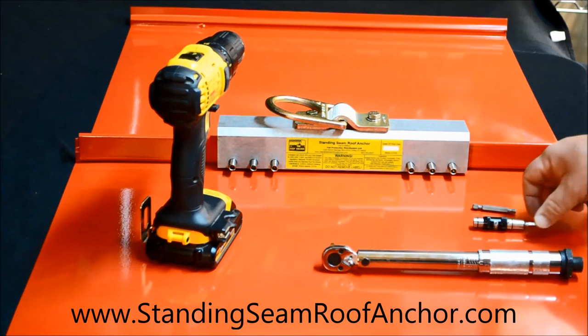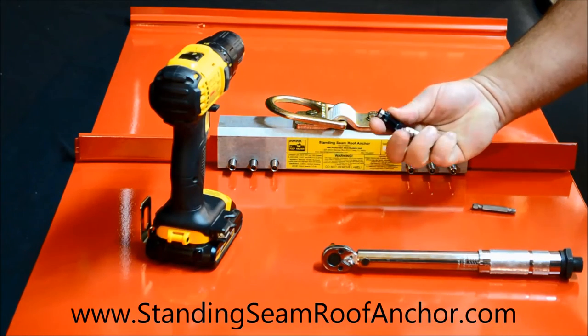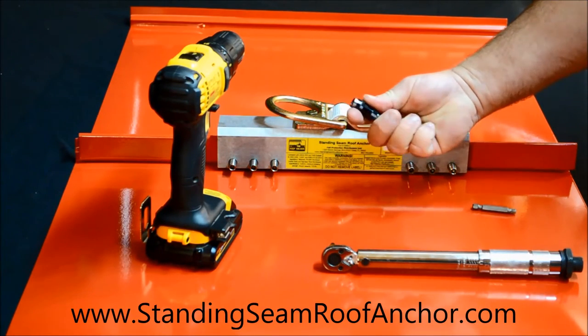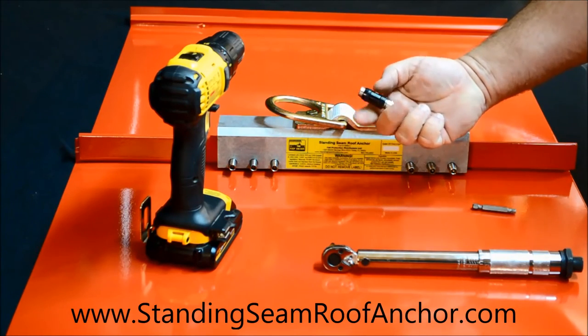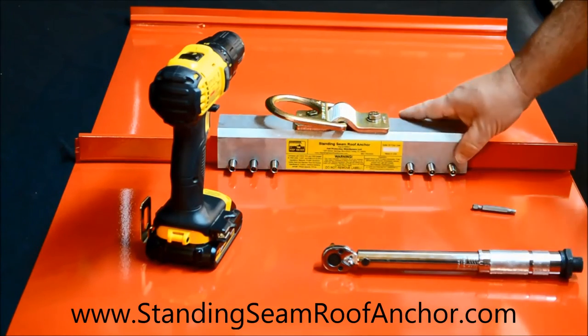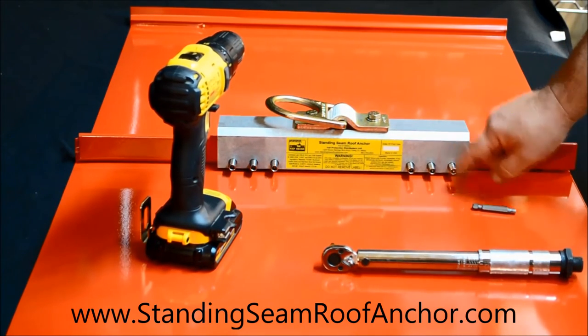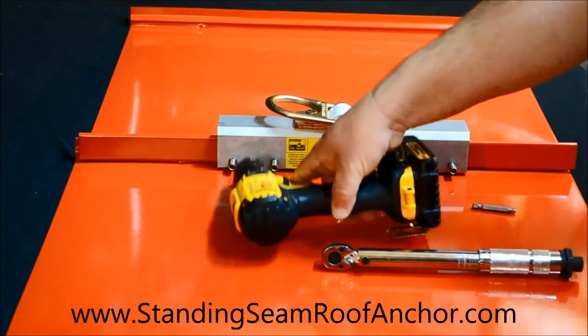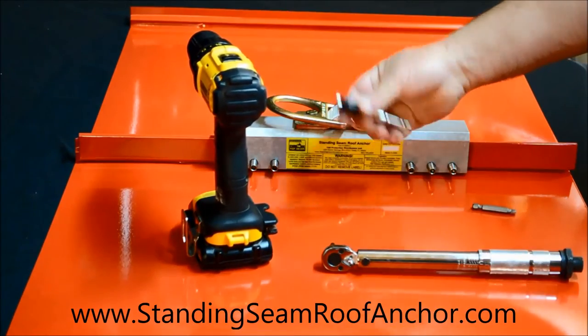With that being said, one tool you might want to have in your toolbox that helps speed things up is just a pivoting bit holder. These are $8 to $10. This happens to be a DeWalt. This certainly helps because on these shorter seams, these set screws can get real close to the seam, real close to the panel, and it's sometimes hard to get your screw gun lined up with the screws. So these pivot bits come in handy. So pick one of those up.